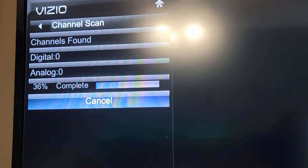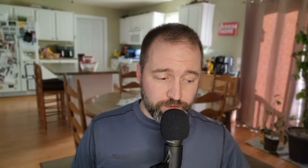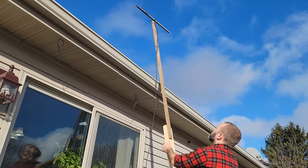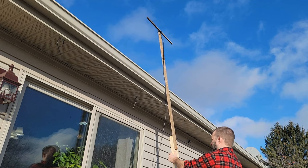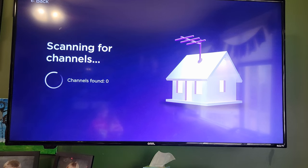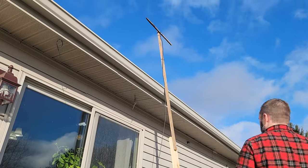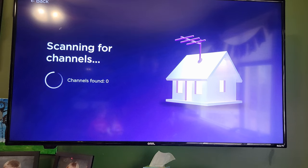You can see so far I've picked up four channels — that's not a lot. I was hoping for more like 20. Scan through your channels and see what you got. If you don't have the ones you're looking for, go outside and move your antenna. In this demonstration I only moved it six inches; in reality I was moving it two feet at a time along my roof edge, along the edge of my deck, my grill area, the front yard, the backyard, and all of the bedrooms. It's a pain. Once moved, go inside and redo the whole process — scan for channels and wait five minutes.